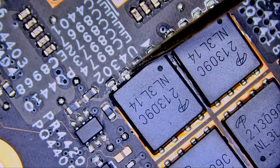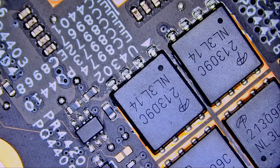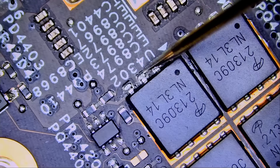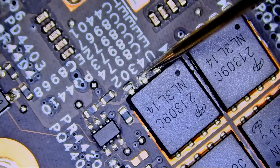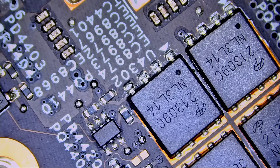In this case we are reading 0.005 voltage drop — still a very low number, but unusual. I always see zero; now I'm seeing 0.005. Let me go to ohms mode. We are reading 3 ohms and not zero ohms, so that's like almost a short — a partial short.